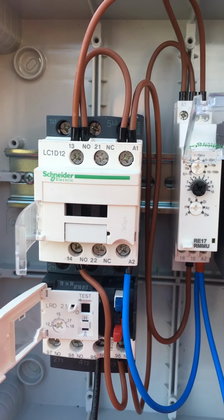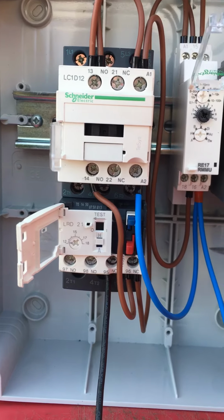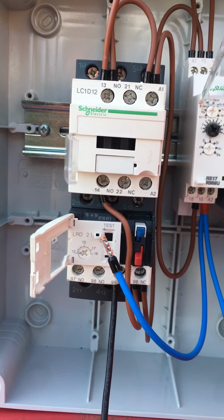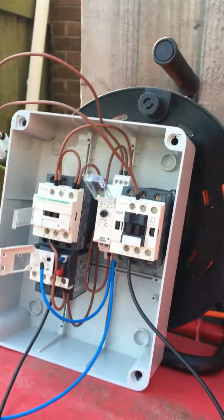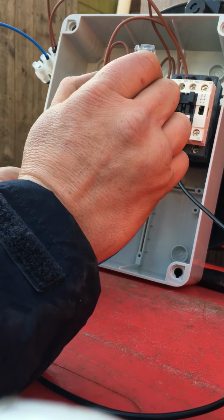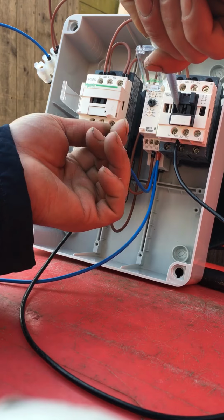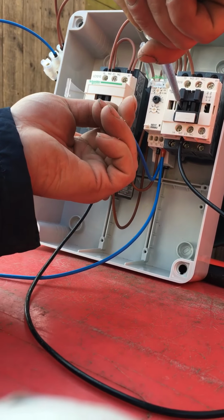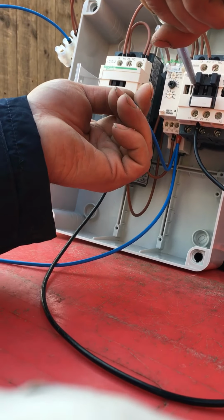You can say, well, Steve, a delay on timer will do that. Yeah, if you put the delay on timer right before A1, you think, that's great. But what happens if you've got a bad neutral? With this bad neutral here, nothing can happen. So what I'm going to do is put the camera here, and then press it in. So that's the LP switch made, everything's ready to go, but we've got a loose neutral somewhere at A2 or further on down the circuit. Exactly the same happens with an anti-recycle timer. On the neutral side, every time the timer has elapsed, then I'm allowed one start.